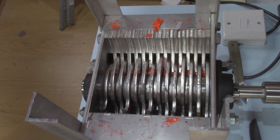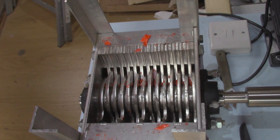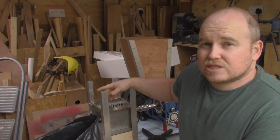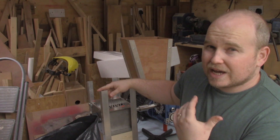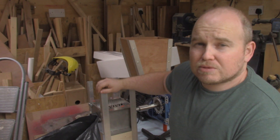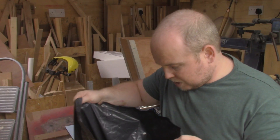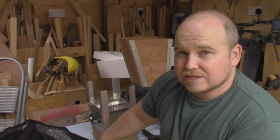This is all powered by a motor that goes through a gearbox and turns at roughly about 70 revolutions a minute. My friend got all the details for this shredder off a website called Precious Plastics — I'll leave a link in the description below, I highly recommend you check it out. If you want to get into HDPE melting and making your own blocks, this is the kind of kit you need. Something like this isn't going to come cheap — you can buy the machines ready-made off the website ranging up to about 1300 pounds, but my mate made this himself for roughly around 800 pounds.